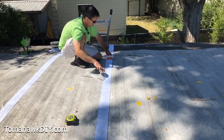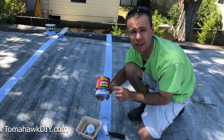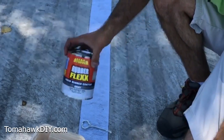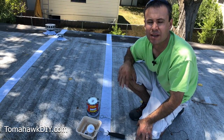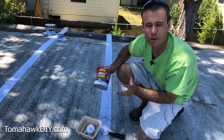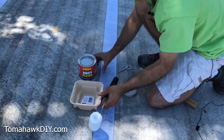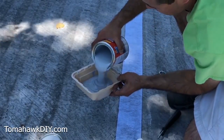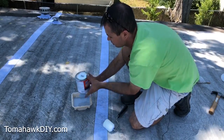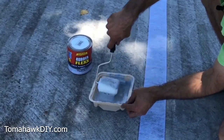I'm using this rubber roller to help secure down the tape along the way. Now we're ready to put on the rubber flex liquid rubber coating — we're going to be using the gray color because that most closely matches our roof, though it also comes in white and clear. As long as your surface is clean and completely dry and you've gotten rid of any debris, it's going to adhere just wonderfully. This liquid rubber coating covers about 65 square feet from one quart-sized can, so that should be more than enough for these seams and repairs we're making today.